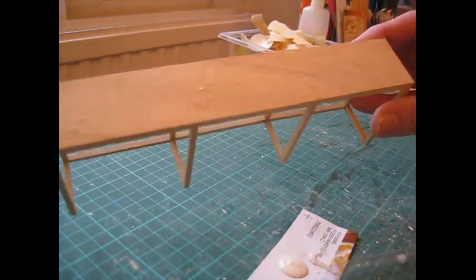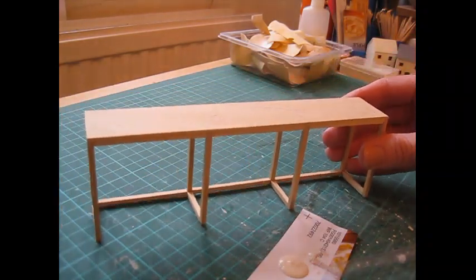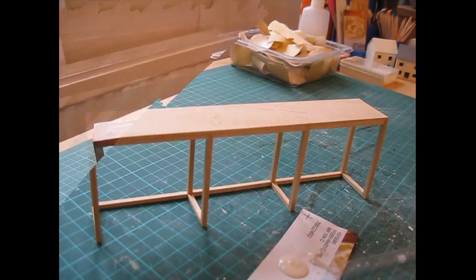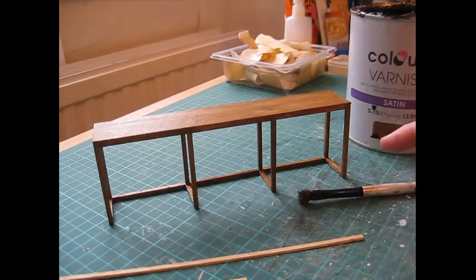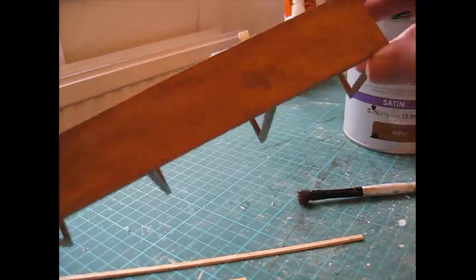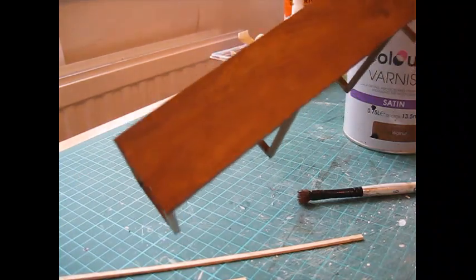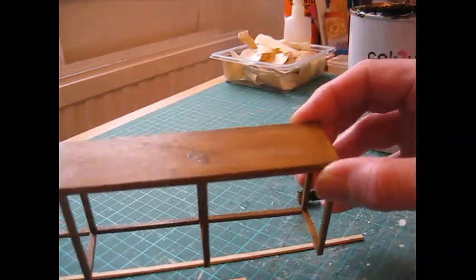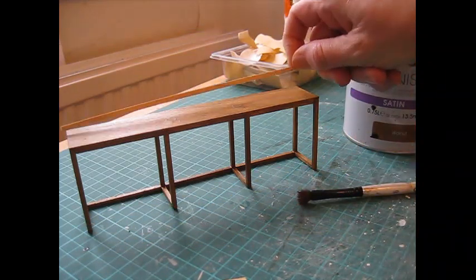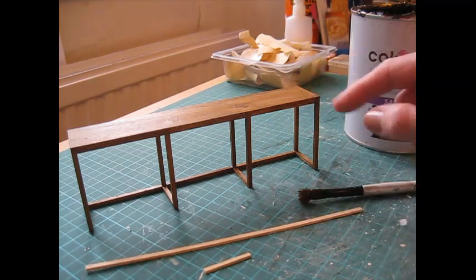Just sort of random little circle marks there — this looks so much better once I've put the varnish on. I'll leave that to dry and then do the first coat of varnish. That's the first coat of varnish on the table — it's still a little bit tacky. You can just catch the cup rings there; they're very subtle but they add a nice little finishing touch. While you've got the varnish out, just do one coat on these pieces too — that's the back support and the side support — and then we'll glue those into place once the bench is in situ.